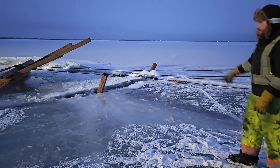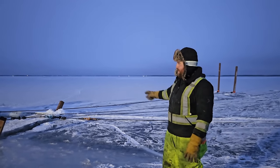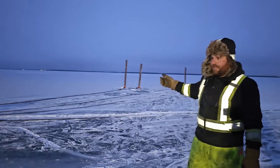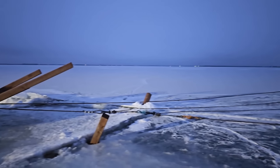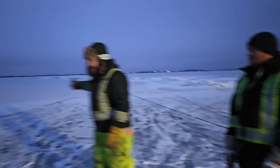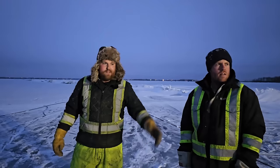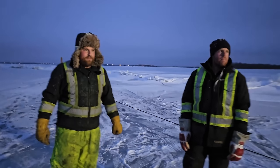As you can see, there's a large ice ridge here, and they tried to cross the ice ridge. It's all around here, so this ice right here is pretty compromised. So we have a compound layup. We rigged for roughly 20,000 pounds, we're estimating. We might be over-rigged. All those timbers you see there are anchors. We got two there anchored for the 3/4-inch line coming up to a block, back to another block off of that second anchor back there, up to another block, back to another anchor, and then this block goes to that anchor, which redirects it back to the far anchor behind the quad, and then it's two-parted to the quad there. Roughly, we're saying around 1250? Yeah, 1250. The quad's pulling. If it pulls heavy, we're gonna do another layup back there, but we're gonna give her a go at this. We're running out of daylight, so try it.